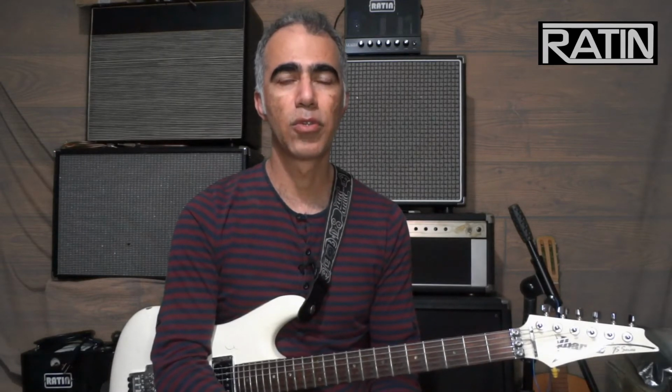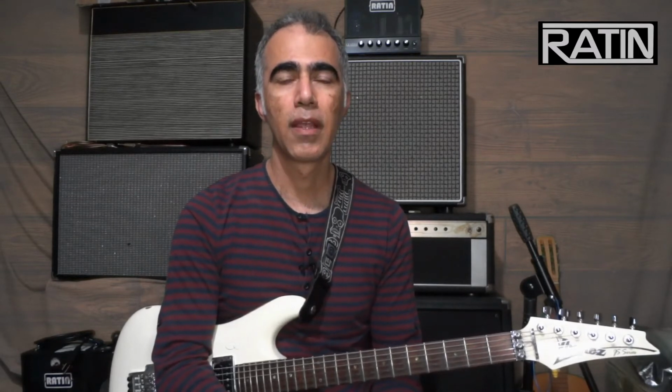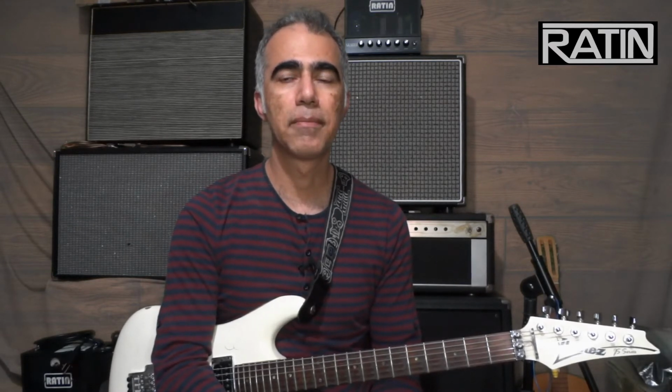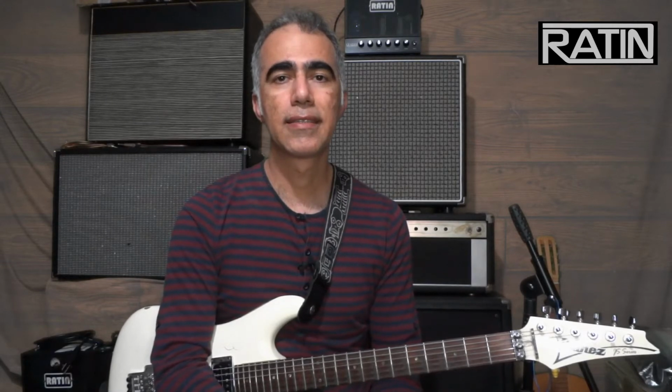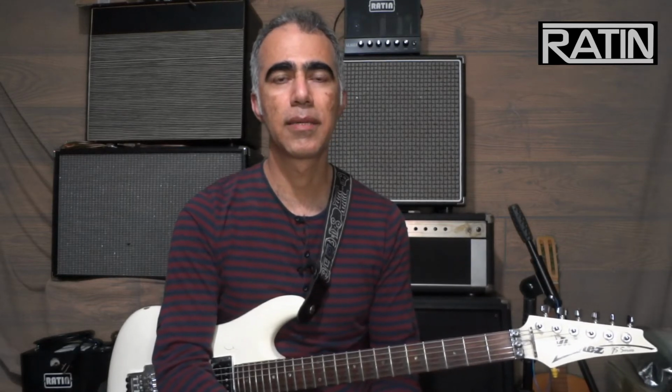The design of this pedal dates back to 2011 as I was experimenting and designing my own overdrive. My goal was to design a pedal that was flexible and as natural sounding as it could be. So I said I don't want to design any overdrive that has clipping diodes in it. So I came up with my own idea and design, incorporating transistors that act and sound like tubes. So I incorporated this design concept into the Blue Angel Overdrive design.